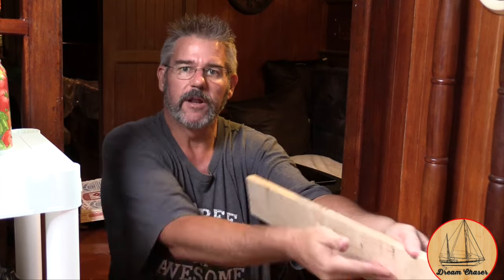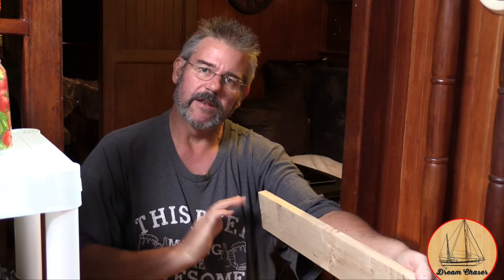I think I found a spot to install the filters — a little to the side of the galley, down in the salon. I've got my piece of wood cut; it's going to go along a couple of vertical beams and the two filters will mount right along here. I'm going to dry fit it first, and then paint down here to get everything bilge-white behind it before I do the rest of the bilge.